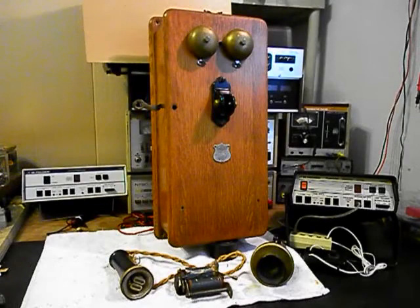Now we're going to have to go through everything. Everything needs to be worked on. We're going to have to rewire this telephone the way we want it wired to work the way we want it to work. Once we repair the solenoid, we will reinstall it and then we'll have to adjust everything and adjust the bells. Now we're going to have to go through the hook switch. We also are going to have to go through the magneto that's in this unit. We have the crank handle and the magneto is not producing the voltage to ring this telephone at this time. It's very hard to turn, and so that is all going to have to be gone through.